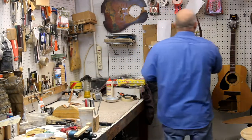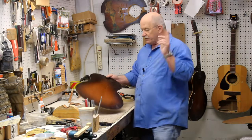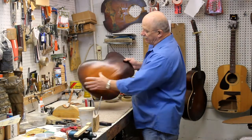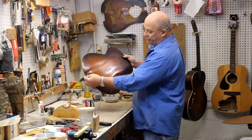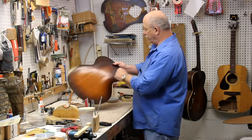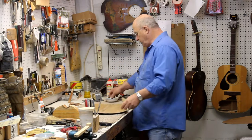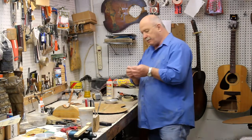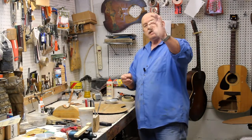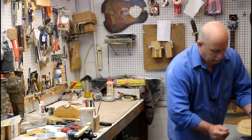Speaking of the back, it is not anywhere near ready to be put back on. First thing we have to address is it's got several cracks in it — this one here is probably eight or nine inches long, and there are a good one here, a good one here, maybe one or two up here as well. I am going to glue those cracks and cleat them with little diamond-shaped pieces of wood, very much like what you see in a violin or fiddle repair.